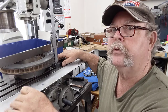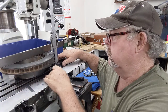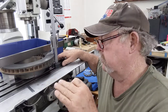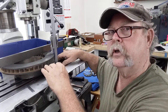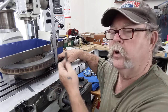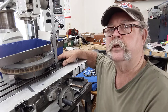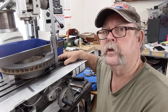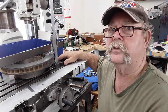This section I put out here is two thousandths below, and out here it's about three to four thousandths, so it's not interfering when I had this inverted. I already checked the other side and it's well within tolerance — tolerance being for these Corvettes with the disc brakes and their age. This is a good rotor. A lot of guys say four or five thousandths; I'll shoot for three.